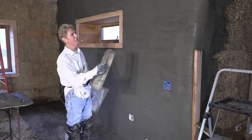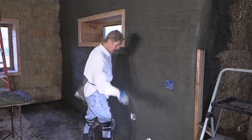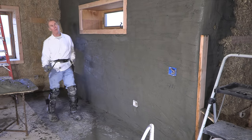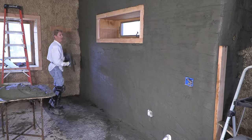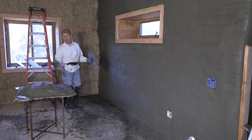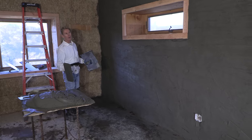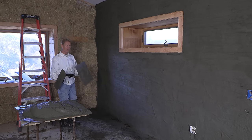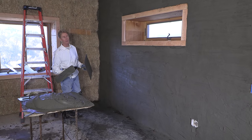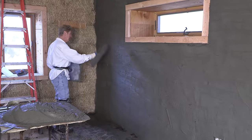Can you do this thick without accelerators? No way — it can't be done because of gravity. And the more I touch this nine inches, the packs will break. What are packs? That means that stucco has set — if you keep messing with it, it's going to crack. That's like a guy called me and said, 'Hey Kirk, I'm using this material but it's cracking like an egg everywhere.' I said that particular material you can only mix three to five minutes. If you mix it more than that, by the time it sets, it'll hairline and crack like an egg. The same thing happens here.